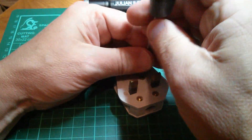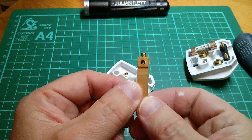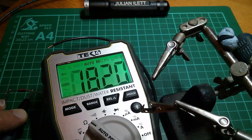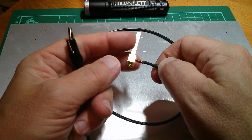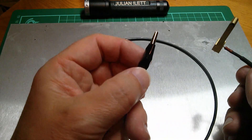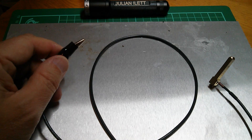Now as you can probably imagine I don't have an anti-static mat, so I'm going to bodge something up using the earth pin out of a plug, a one meg resistor and some wire. Well I couldn't find a one meg resistor but I've got a nice old 1.8 meg resistor here that'll do. So here's my bodged up ESD mat — anti-static mat — earth pin there with the one meg resistor, a piece of wire and a crocodile clip which I'm going to attach to this piece of aluminium.